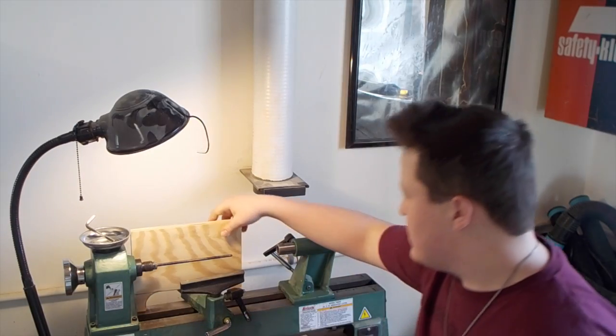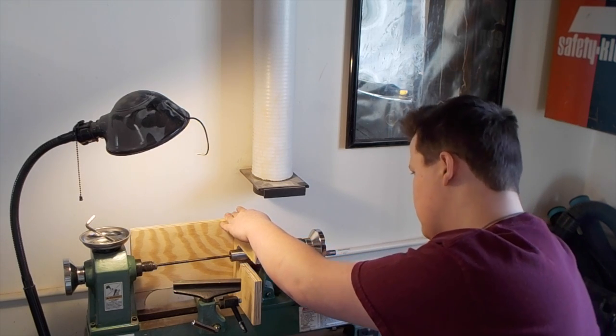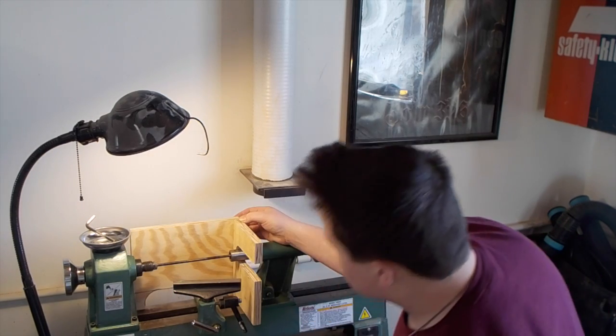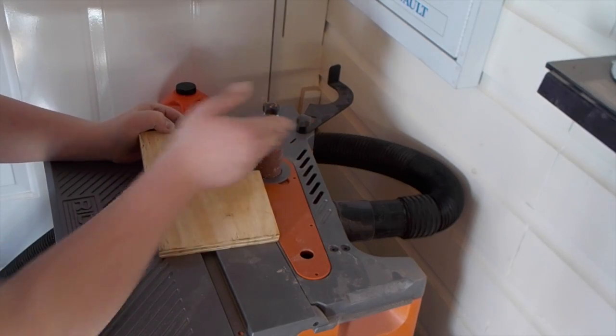So I am going to measure the length of my pen mandrel and base the length of the box off of that, which means I have to recut this back piece as well as the pieces for the top frame. That's what I get for not carefully thinking through this. I've just recut this piece — I can bring my tailstock through this way, so I think that will work out just fine. Now I'm going to give all the pieces a quick sand at my spindle sander.